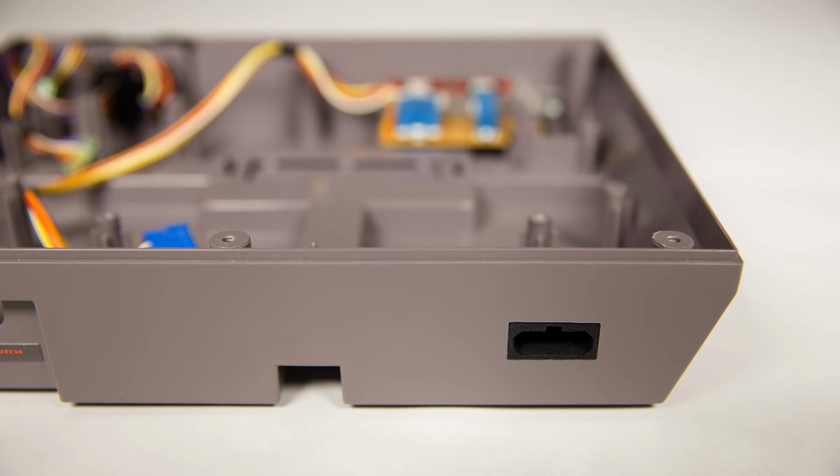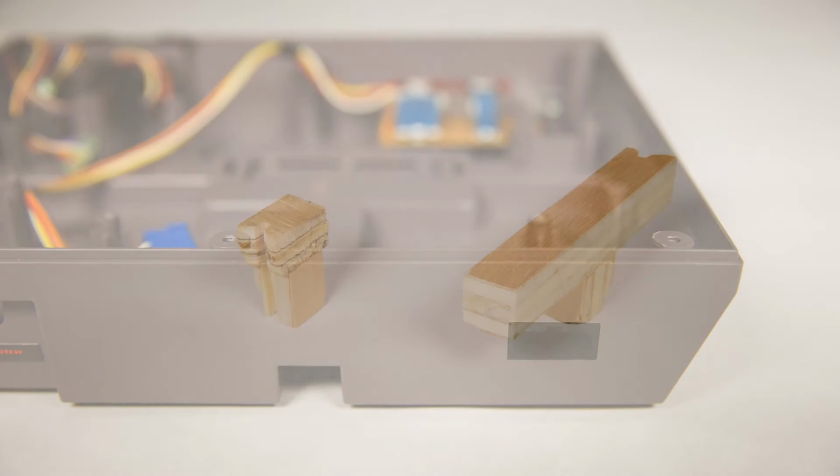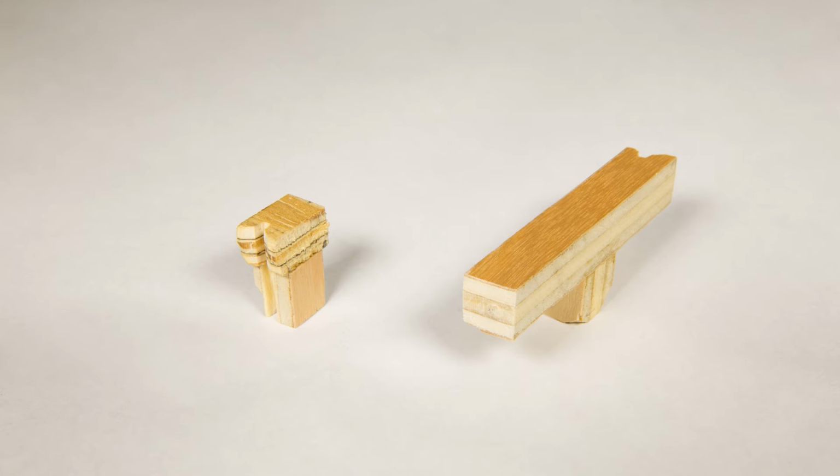With the multi-out connector, you're normally supposed to drill a hole on each side of the connector to mount it with screws. But again, I'm a minimalist, and I really felt the screws would detract from the appearance of the perfectly flush connector. I could use hot glue, but hot glue is a mess. It's ugly and it isn't very strong. I could use epoxy, but epoxy on relatively smooth surfaces doesn't always hold up very well, and it's a hassle to repair if it gives up. So I did some more thinking, some more measuring, some more manual labor, and created these unassuming little support struts.